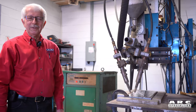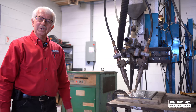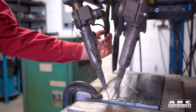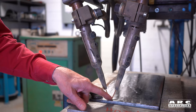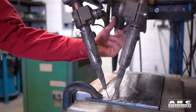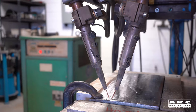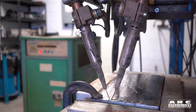For today's demo, we pulled an old power supply out of the museum and a couple of old controls and motors, and we set it up to run what we call series arc. In the series arc, one of the welding cables is connected to one of the output terminals, goes through the wire, and the current flows through the wire, through the arc to the plate, up through the other arc wire, and then to the other welding cable connected to the other terminal of the power supply. So the wires and the arcs are in series with each other. We have one power supply, two wires, and two arcs. This is a 3/32 wire, so we'll run about 450 to 460 amps — just one current flowing through both wires.